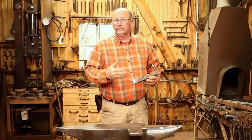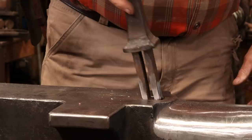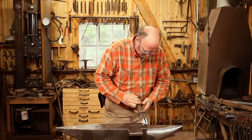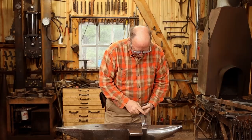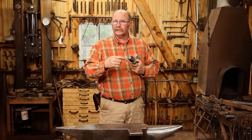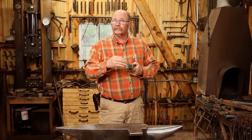That doesn't take very much grinding and it just darn near fits. It actually fits in one direction, almost in the other. We've got to figure out what the difference is and why it holds up — it's not perfectly straight, but that's a feature left over from the old anvil because it was made to fit that. I use it this way, so I don't really need it to fit the other way quite as much. If there's some patina or scale on the shank, you might be able to just work it up and down in the hole and see if it rubs some shiny spots to tell you exactly where you need to work.